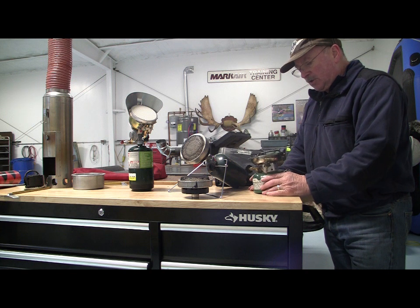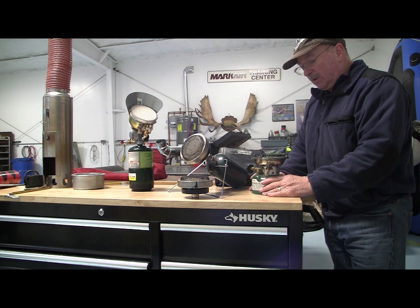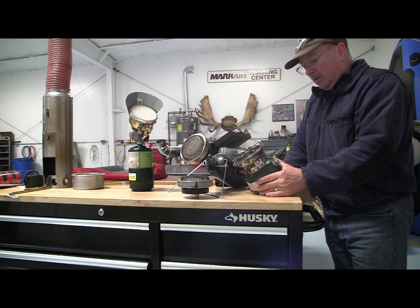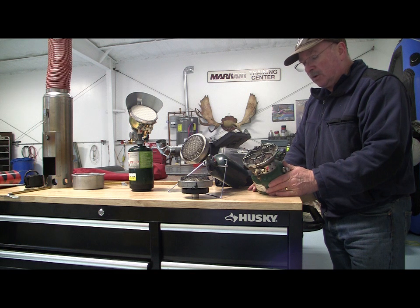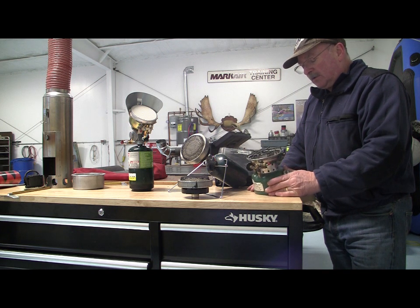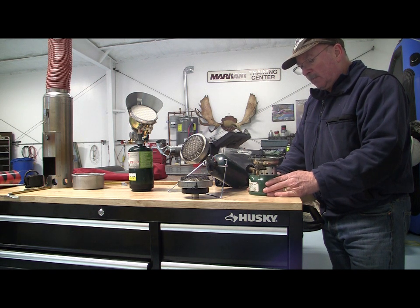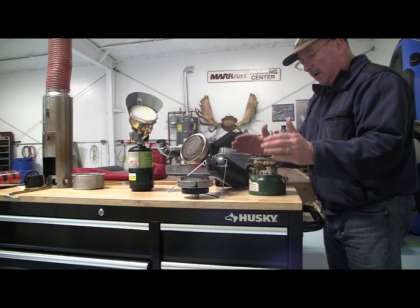My first airplane was a PA-12 that I operated during the winter on Wesco wood skis on a grass strip on Farmer's Loop up in Fairbanks. And this is my original preheat. This is nothing more than a Coleman camp stove that runs on Blazo or white gas. I'd go down to the airplane at 6 in the morning and light this off and set it in the snow, get it cooking.